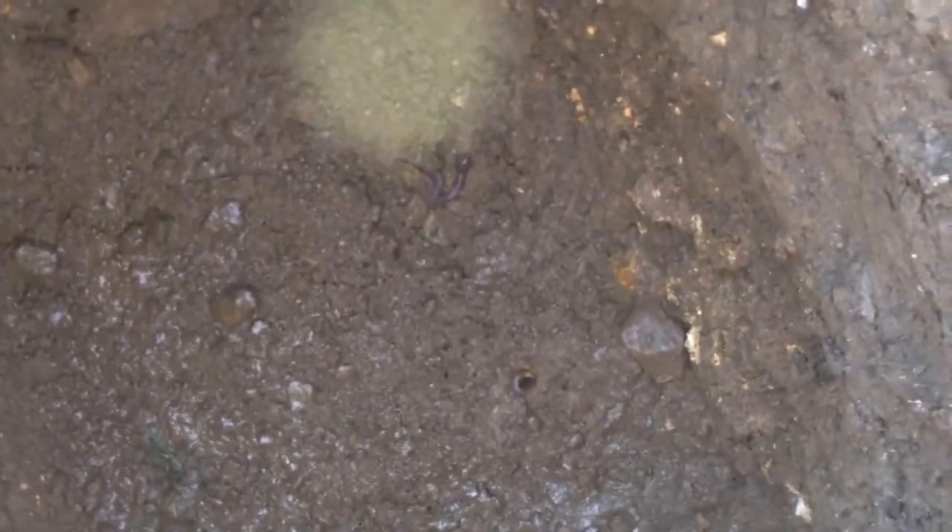So there we go, we've waited two hours. The sun's extremely bright but let's see what's in the hole. You can see in there — it's just damped the soil, the water's gone. There's no depth to the water at all. The conclusion is that the water has drained away well. There shouldn't be a problem with permeability — the percolation test is a good result.